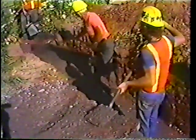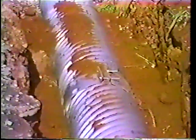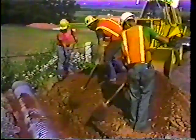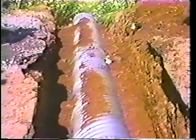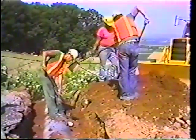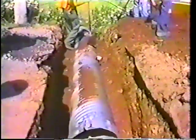Prior to doing this, foremen like to lay down a thin 2 to 3 inch bed of loose material that acts as a cushion for the pipe and helps it settle against the smooth, hardened earth. Once the pipe is in place, loose material should be laid along the sides of the pipe to form a cradle. This material should not come above the halfway point on the pipe. What you want to do here is to hold the pipe firmly in place, not to lose your grade, and not to dislodge the pipe from the position that you have decided is best for it.